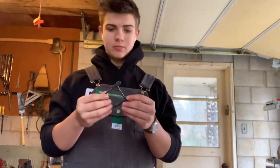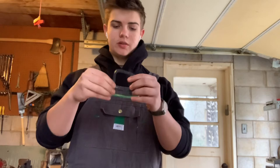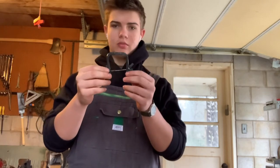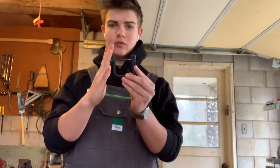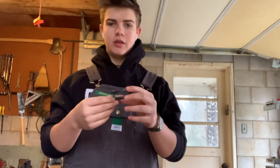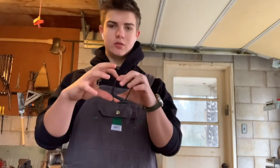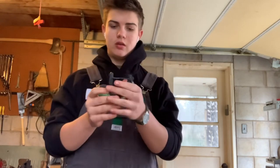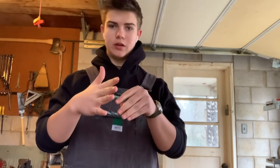I'm going to pause and speak about this, but I did get film of me making it. So this is where the progress is at now. I drew it out, and then I bent one side over at a 90 degree angle. Then I used a piece of square tubing to bend the other side over and make sure it was wide enough. And then these tails were probably about this long, and I bent them over at 90 degrees in a vise.